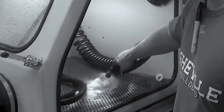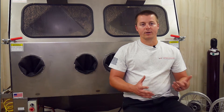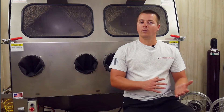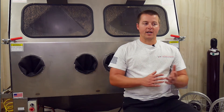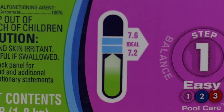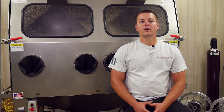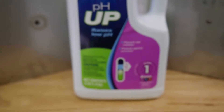The biggest problem you will have between water sources is a chemical reaction with the abrasive — a pH change. That chemical reaction between the abrasive and your water could change the pH from its normal range, which is 7.1 to 7.2, either acidic or basic. Either change could cause a drastic effect on the process itself.